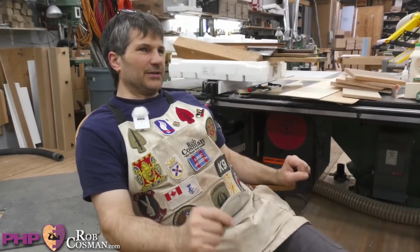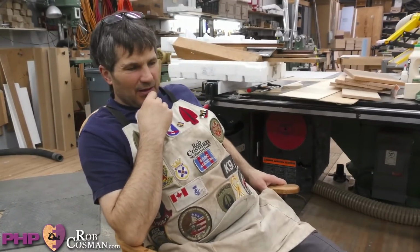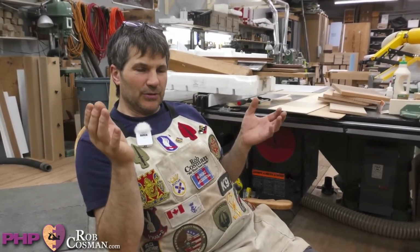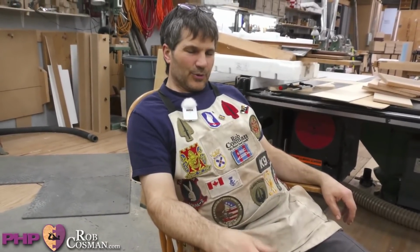As far as woods, you want something that is not going to be susceptible to rapid deterioration from UV light, and something that's going to work well outdoors. So teak comes to mind. You think of what woods are used on boats because they get wet constantly and weathered, and teak would have been the number one wood used on boats. Teak's going to cost you a little bit, but you can also get Brazilian cherry, known as Jatoba, and that's a miserable wood to work. It's like carving a rock, but that would wear well outside.